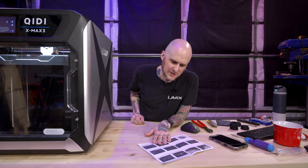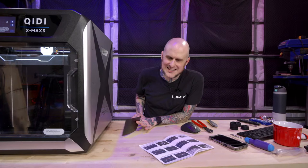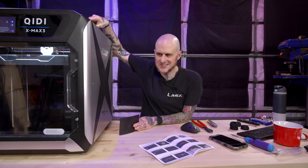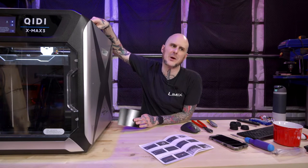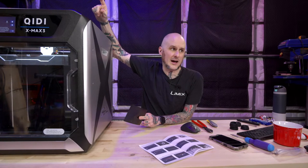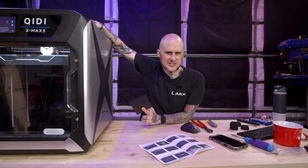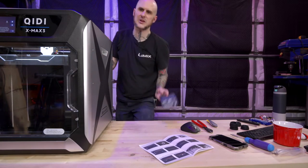Okay. Oh, you know what? I don't think it's PID tuning. That's not what it was doing. I get it now. What it was doing was heating up the bed to, does it really have a BLTouch? Yes. That is probably the weakest thing on this machine. I don't understand that. They are running a BLTouch in a heated chamber machine. Don't get it. What it was doing is it heated the bed so that I can do Z offset while the bed's hot, as you should. It just homed so I can do a Z offset.